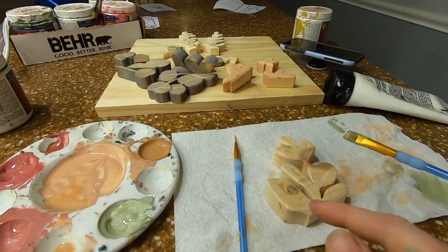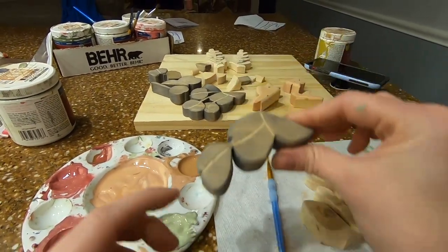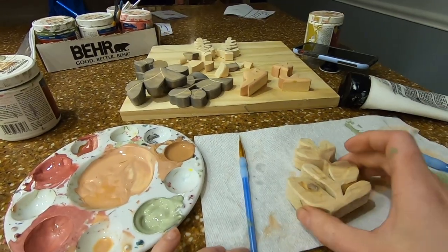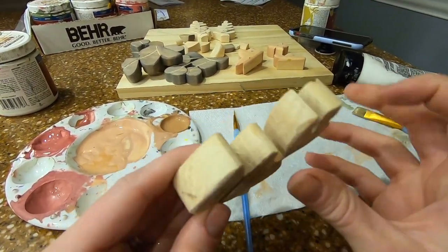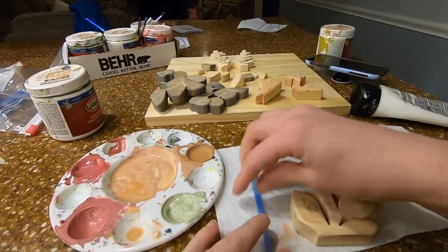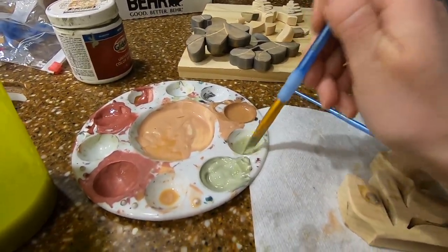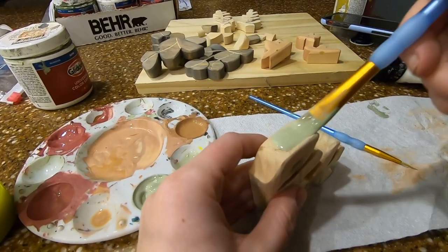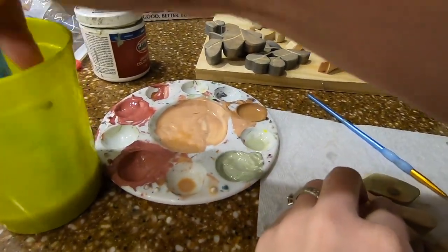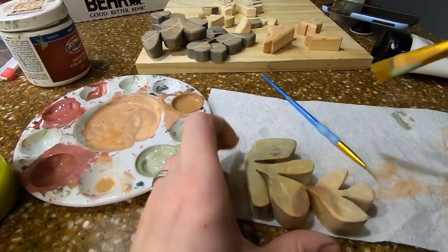When it comes to staining and painting the pieces, there are really no rules to this. I love the wood grain look. The clovers I did in a classic gray stain by Minwax — I love that color because it's really a blue gray. For the greens, I actually take just basic paint — you can use acrylic, or sample paints from Lowe's or Home Depot, the Behr paints. Once you have your color, you just want to water it down — just a bunch of water and a little bit of paint — so you have that tint and it just acts as a stain. You brush it on all over and wipe it off, and it just leaves a stain versus a heavy coat where you can no longer see the grain. You can go as light or as heavy on that as you want.